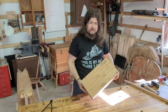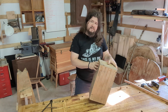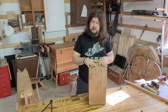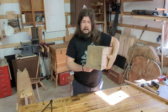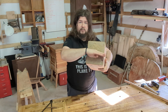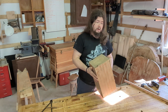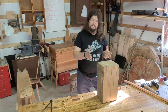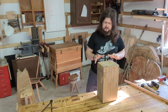It's very useful to have a thickness planer. If you don't have that you can use a hand plane. If you don't have that, you may be able to pick the straightest board that you can and just do it with clamps. I oriented these so the end grain is curving like this on every board. That way it will grow and shrink with the seasons and minimize the chance of cracks. I don't want to mess around with opposing them. I'm not trying to keep this perfectly flat — I just want it to not crack.